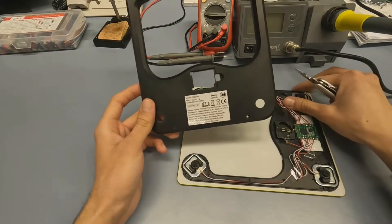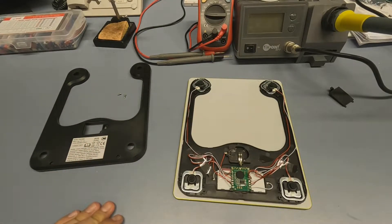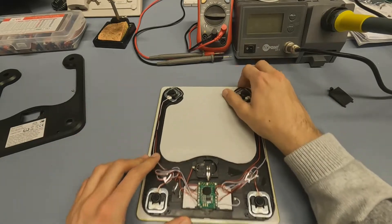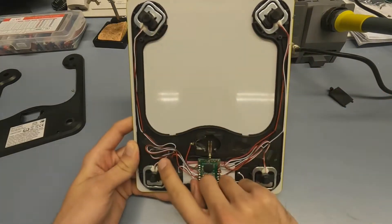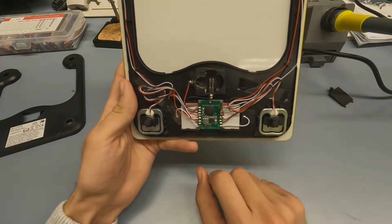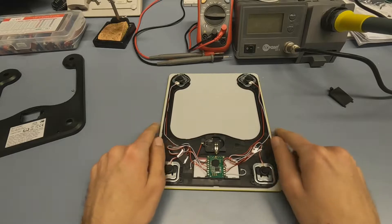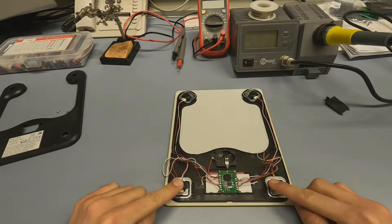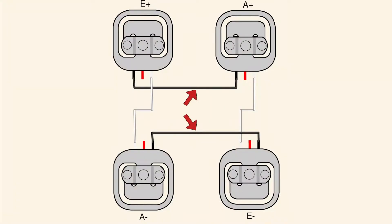Save this for later so you can plug it back up once we're done and make it a bit more resistant. Now as far as the kitchen scale's electronics go, this is the brains taking up an input from these four load cells connected together. We're not going to be using any of the kitchen scale's own electronics, so we're going to cut all of these and hook them up together in a circle. When connecting, it's important that these two are connected with the same color as these two, and that these two are connected with the same color as these two — so this can be black, this can be black, and these white.